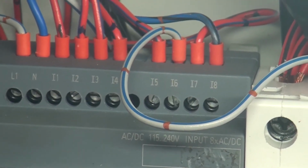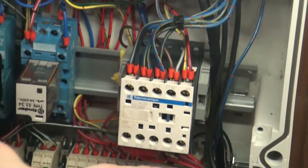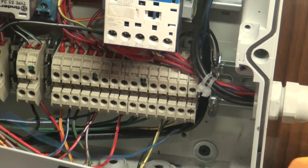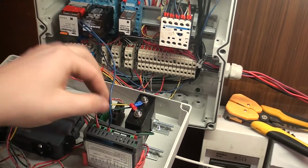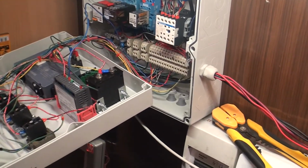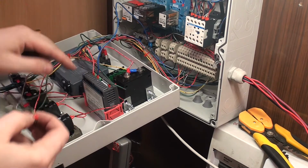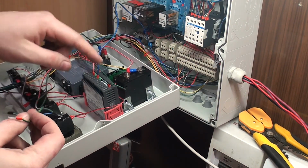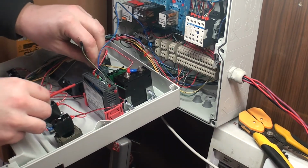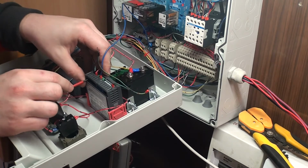So I got the wires made. As you can see, input 8, I8, has a wire now, and it goes down into this last terminal block, and then a wire comes from that and goes into the input of relay 2 over here. I also made a couple of wires. Actually it's just a 3-way wire, so it goes to relay 2 and then the power, because it's the live wire. So that's that one. I'm going to try to put it in right now. So relay input 1.